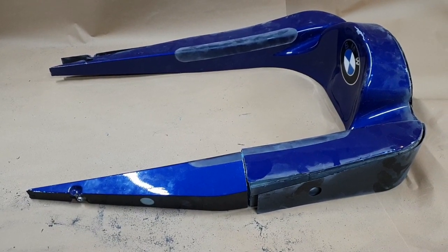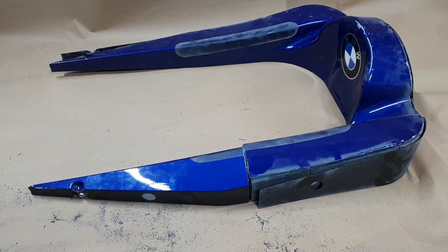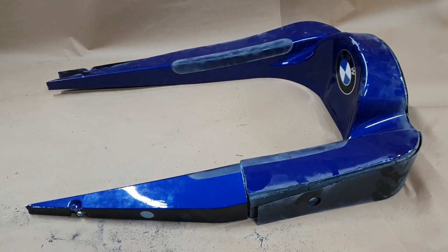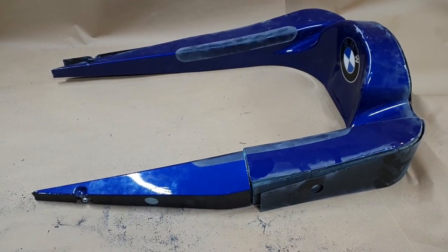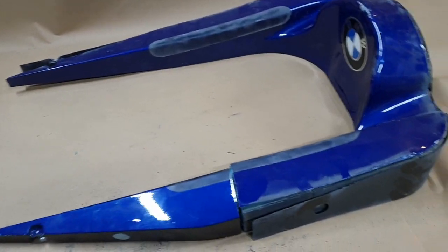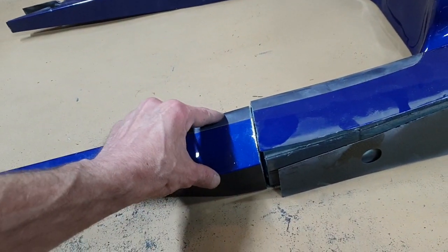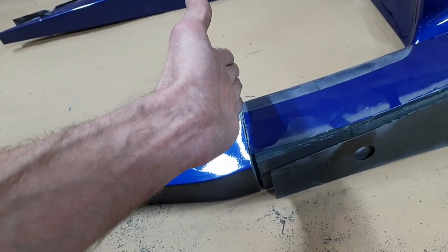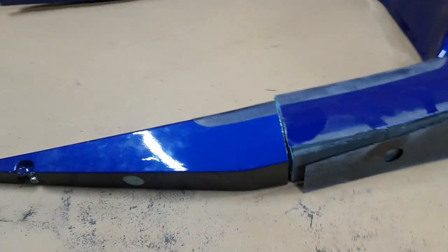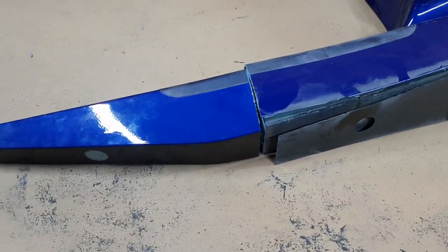So I generally look at the part first and think about if I was to make it, how you would do it, how it's bonded together. Now, if you cut a part up the wrong way, sometimes you can't necessarily see bond lines which you've cut through or how it was made. So in this case, obviously the foam has to be put inside the part somehow. So I knew this would display all the join lines. You know, there's 4 on the 4 corners. So that was my first cut of choice there, straight down there, just with a small grinder.